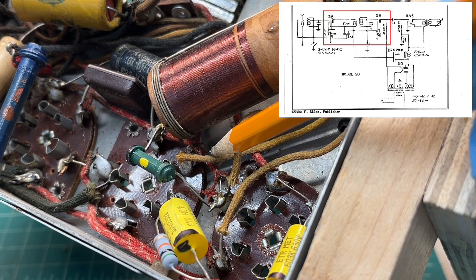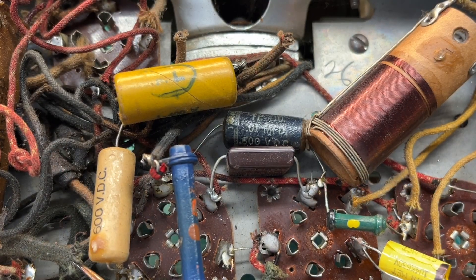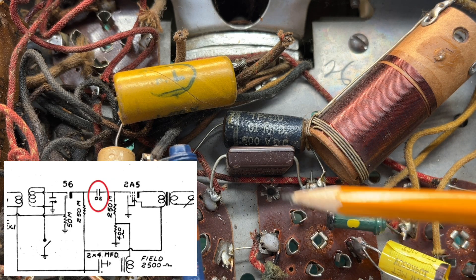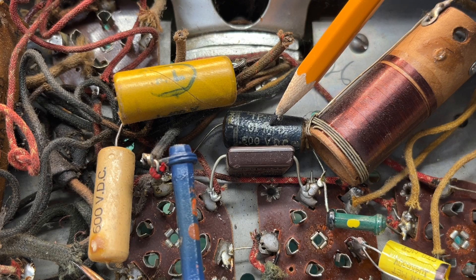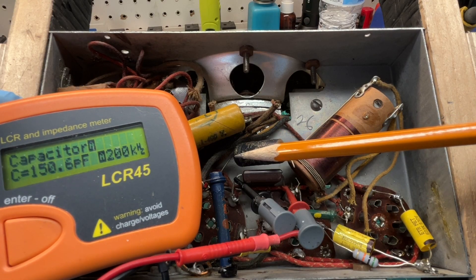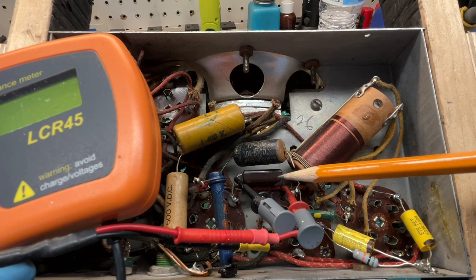My schematic does not match this configuration, so I'll just leave it in place for now, get the remaining components out, and come back to this. The resistor itself is just under 20% high. You'll notice an old 0.01 microfarad cap coming from the plate of the 56, feeding the grid of the 2A5 — I'm going to get that swapped out. In addition, you'll see another bypass cap, a mica cap, the brown cap. I'll check its capacitance — reading about 150 picofarads, probably just acting as a filter to shunt RF to ground.